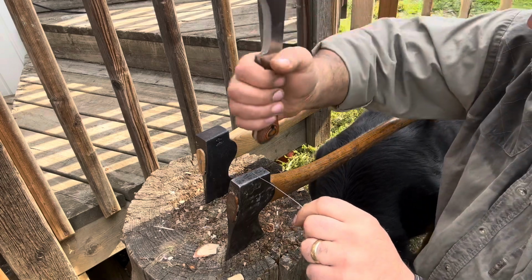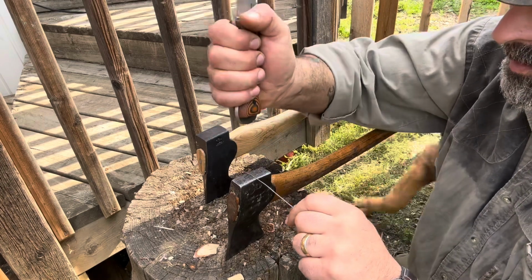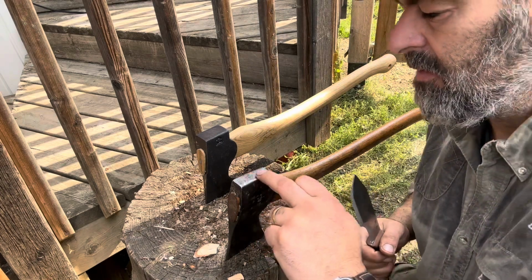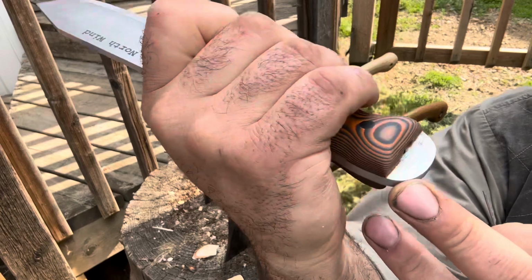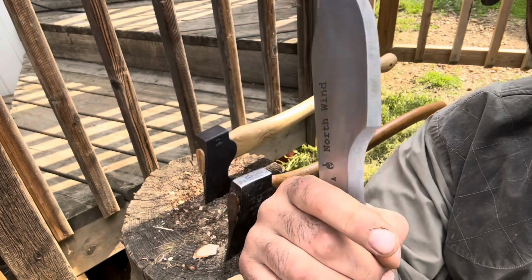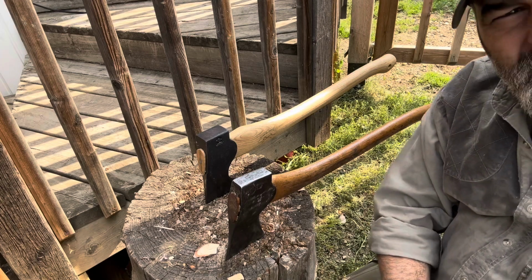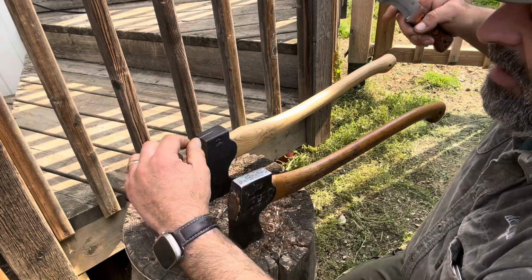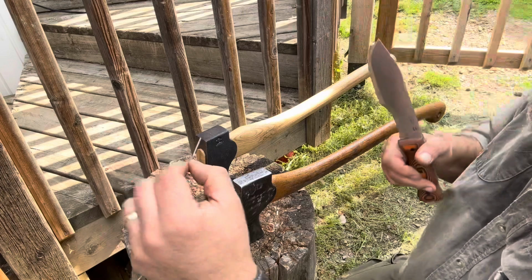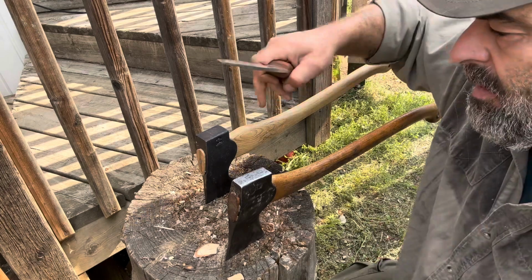So when we put this wire here, and we're trying to cut it, it doesn't really cut that easy because this is soft steel, right? The knife doesn't even mark, you see? Knife doesn't even mark. That's a William Collins knife anyway. They're about 61 to 63 Rockwell hardness. Now, when you hit it with this, because it's a hardened poll, you see how easy it cut that? Because this is a hard steel.